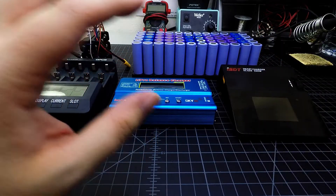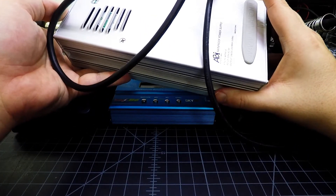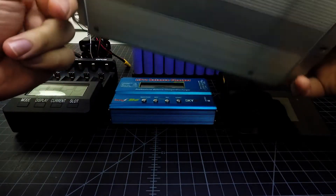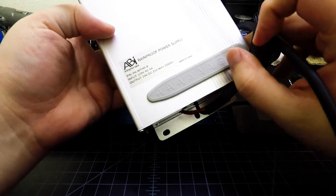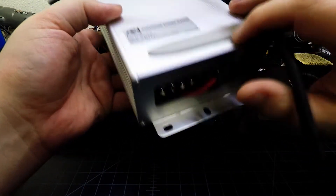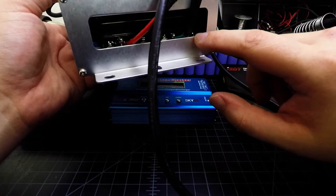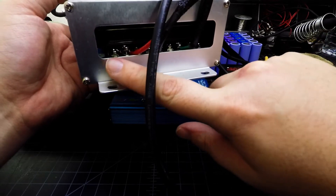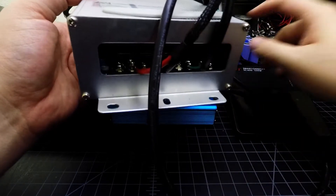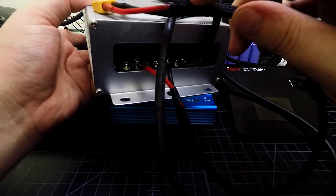It does not have a built-in power supply, so to feed 500 watts I also picked up this very large power supply. It's a 24-volt output, 500-watt supply. You do have to do your own wiring — wire it to AC mains — and it has three parallel DC outputs. I made up a quick pigtail with some nylon mesh to connect it.